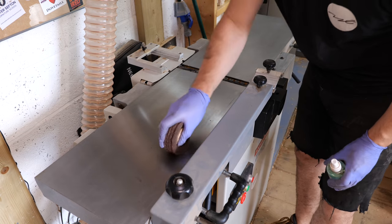The machines are now degreased and it's time to start getting rid of some of that surface rust that has accumulated over the past project. For this, I like using an abrasive mesh. I don't have any pads of it, but I do have this satin mop that I've used so much it's now very small. If you've got any heavy pitting or you've just bought a secondhand machine that is disgustingly rusty, you might want to use some sort of rust remover. But because I stay on top of this, it's just scraping off that upper layer, so you can go straight at it with your abrasive.